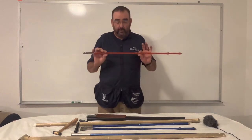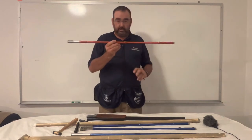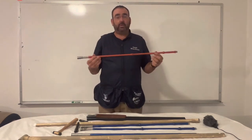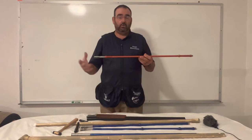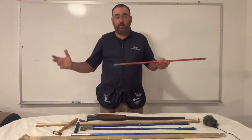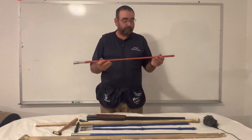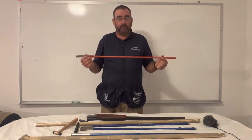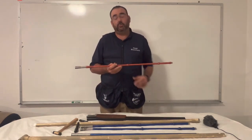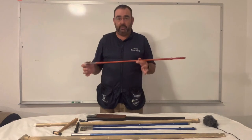With these, you have two basic options through Briley Manufacturing, who makes them. You have your companion tubes, where you tell them you want tubes for a Browning 725 with 30-inch barrels, a Beretta 686 — whatever gun you have — and you tell them the model, barrel length, and gauge. They will make a set of tubes and send them to you, and they should fit right into your gun. Generally you'd have skeet chokes with flush mount chokes. That's the cheapest, easiest version.